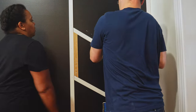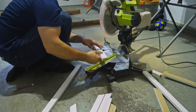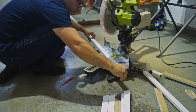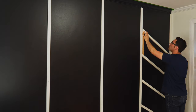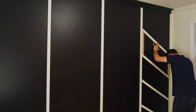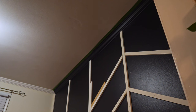What you'll notice is the spacers in between the two cuts. We decided to go with 16-inch spacers, but I believe the more common size is 12 inches — you should definitely measure it out yourself and see what you prefer. Once I got the first two cuts down the rest went pretty well, but I got a little zealous and ended up cutting all 20 cuts without taking into account that two of the areas the cuts would be going the opposite direction. Luckily everything was cut a little long, so I was able to flip the boards and still use them.